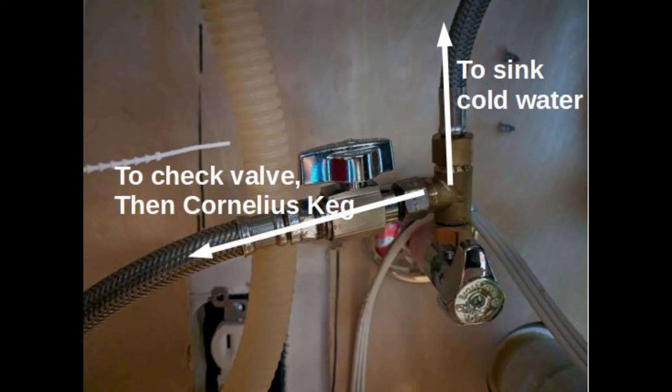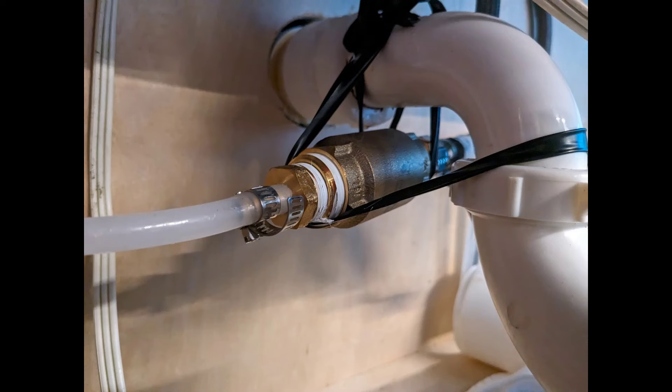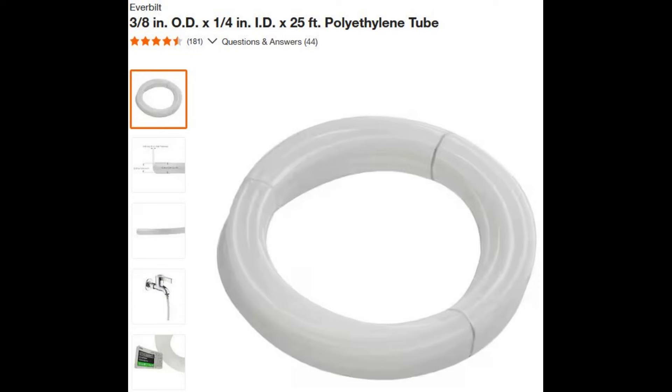Now it doesn't go straight to the keg — there's actually something called a check valve. You can pick it up from your local hardware store. It makes sure that no water comes back from the carbonated water system into your house water supply; otherwise you'd be showering with carbonated water, and that's not something you want. All the tubes I used in this thing were polyethylene tubing, which is usually used to pipe water to an ice maker in a freezer. I chose it because it imparted little to no flavor. I tried vinyl tubing — even beverage grade stuff used in other keg systems — and it just gave some flavor. The polyethylene tubing gave the least flavor and was very simple to work with.